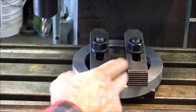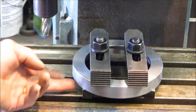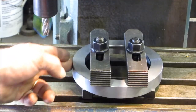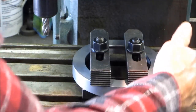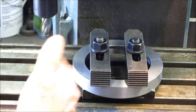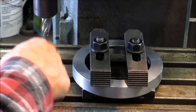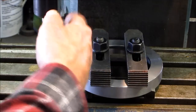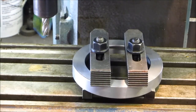We've got the first ring set up, clamped down with 5/8ths clearance underneath it. We're going to skip this side and come around to the other side and take an equal amount off without unclamping it, keeping the two straight lines parallel with each other. We're taking 5/16ths off each end, bringing it down to 4-3/8ths on the width.